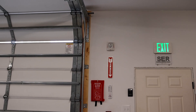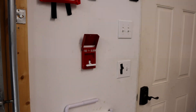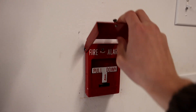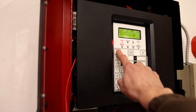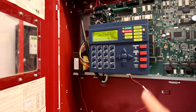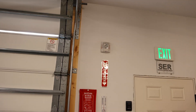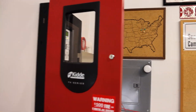This is EST voice evacuation that you're hearing. Let's go ahead and reset the RSG RMS-1T pull station, then reset all the panels, and then activate the police pull station. That's now reset. This panel is now resetting, and then we'll give a main reset on this panel. This panel is reset and the other one has reset as well.